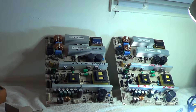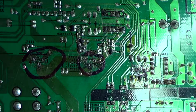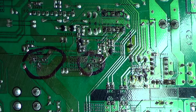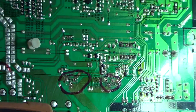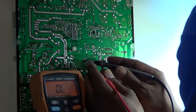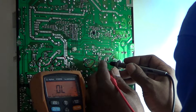If you have anything close to that, you can try to replace those. I'm going to go ahead and replace those on one of the boards and see what happens. I did remove those FETs off the 42 inch board — located here — and yes, those are already short.